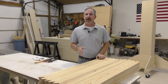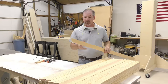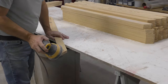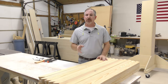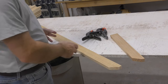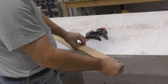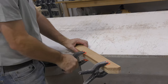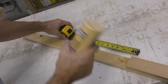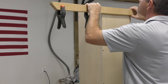It took a little while, but now we have all of our slats cut. We went over to the miter saw and put a 45 degree cut on the bottom edge, and we spent some time sanding to knock the sharp edges off and get any burrs off as well. Now we can go ahead and start installing these onto our mast. Our slats will extend out 16 inches past each side of the mast, and to simplify the spacing I cut a 16 inch spacer that we'll use as we go. We'll prep each slat over at the table before coming over to the mast to install it.